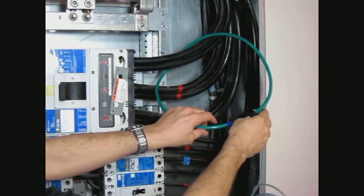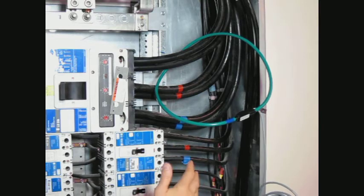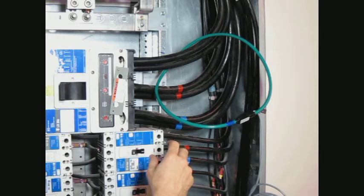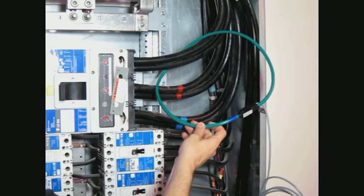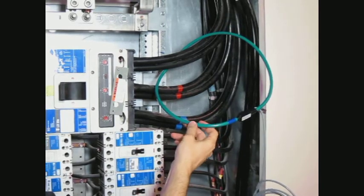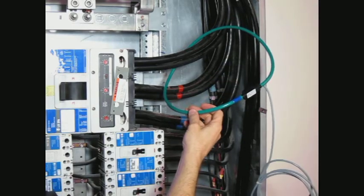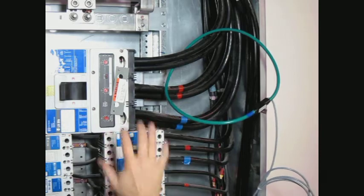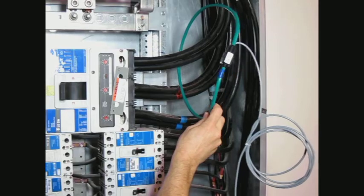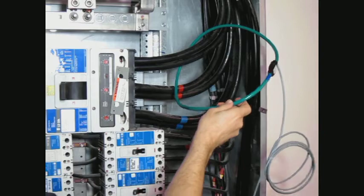It's also very important when you're connecting a Rogowski system to be sure there's some load on the panel. As we noted in our previous standard installation video, you always want to check the MPU stats page to be sure that your voltage and CT connections are in phase. It's also important for a Rogowski coil system as well. And to test this, you want to have some sort of load on the panel. You don't want to do this with all the loads shut down, because the Rogowski coils are designed for larger loads, so you want to be sure you got a true reading when you're making that verification.